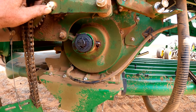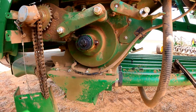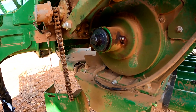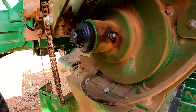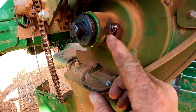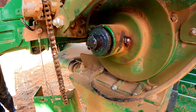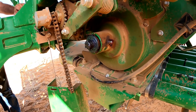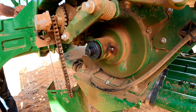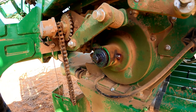We're going to see what we can do to fix this. Now that I'm looking at it, I've seen this problem before. It looks like they probably greased that grease circuit right there. If you shoot a lot of grease in that grease circuit, you will push that bushing out and it'll try to push that sprocket off of the shaft. Keep in mind that your operator's manual calls for about two shots of grease seasonally — it doesn't take too much, and it can get over-greased really quick, especially if you have a battery-powered grease gun.